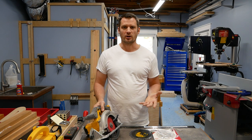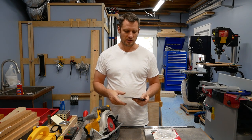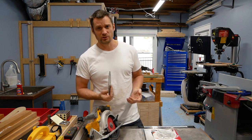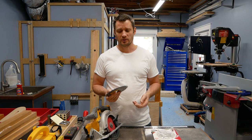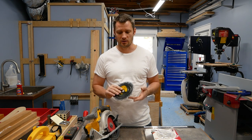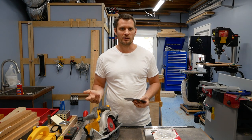I needed to cut some hardy plank siding for the side of my house. In the past I had to cut a couple pieces and I had an old six and a half inch blade from this saw, so I just used that. Does a regular wood cutting blade work on hardy plank? Yes, it does. It's not super effective, but it gets the job done and you can make a clean cut. I was just keeping this around because I only occasionally cut hardy plank.